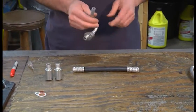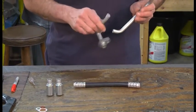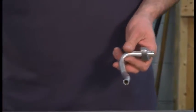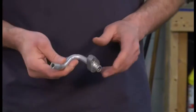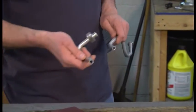As you can see, after you've cut the old fittings off, you've got a lot of burrs and we need to clean this up. You can use something like Scotch-Brite, even rough sandpaper, but in most cases a bench grinder with a wire wheel works best. So at this point, we want to go ahead and clean these fittings up in preparation for brazing.